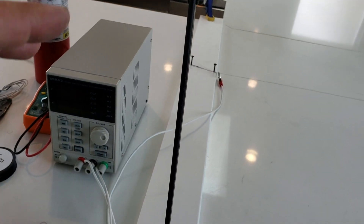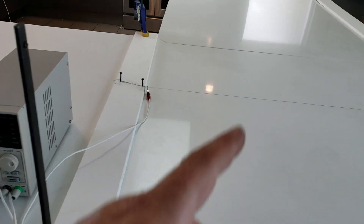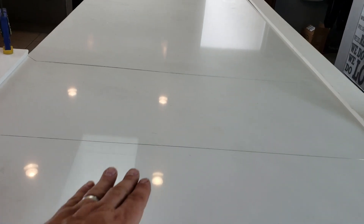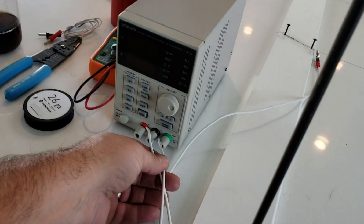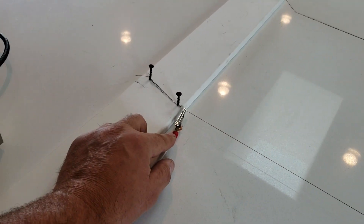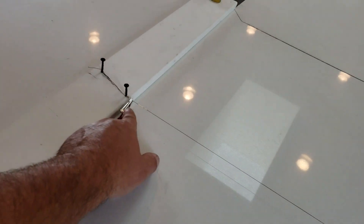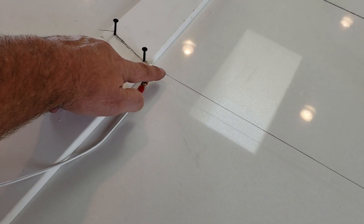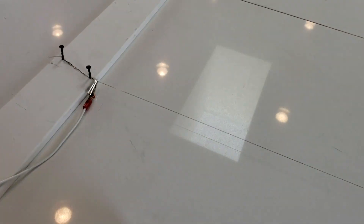The basics of cutting foam: we're putting current through a wire. The wire is going to offer resistance. That resistance transforms electricity into heat, which is going to cut the foam as it slides through. We just took some regular hookup wire and put a couple of alligator clips on. Here's the positive side and here's the negative side — so the electricity flows through the wire, resistance, heat, and back. What's interesting is the regular wire won't get hot, but the resistance wire will be 600 degrees because that's where the circuit is.